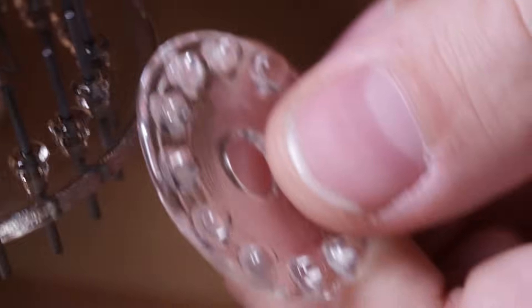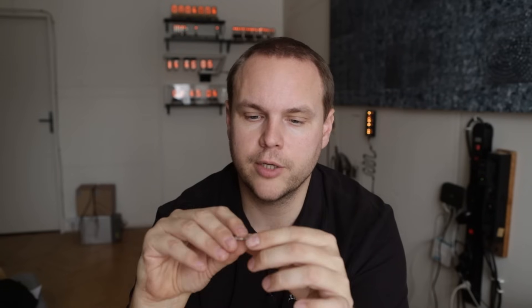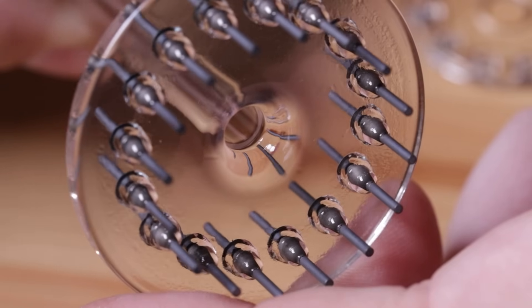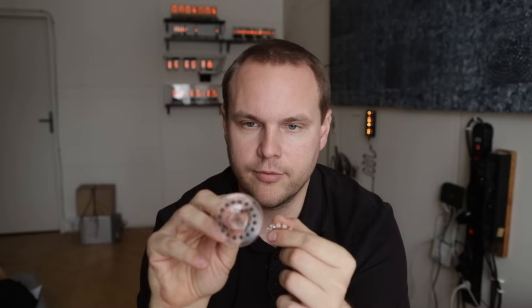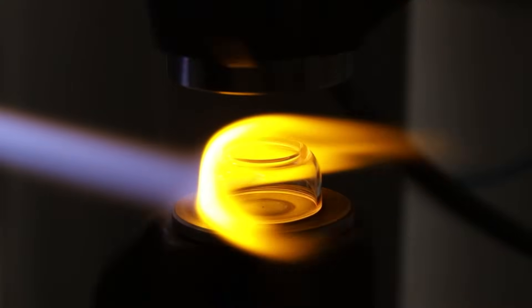In the next attempt I will redesign the molds and make a few changes. We will add an exhaust tube so that we have one piece of glass together with the exhaust tube. We will still work without pins — I want to first test the glass pressing before tackling the metal sealing. We will also try to make the glass fully fill the mold, as I can see round edges where it didn't reach the corners. And finally I want to improve the mold surface to achieve a beautiful bubble-free, machining-mark-free surface like on a commercial stem. That's for the next video — thank you for your attention.